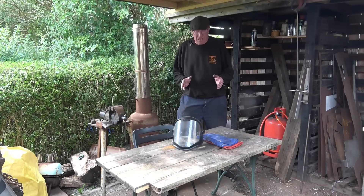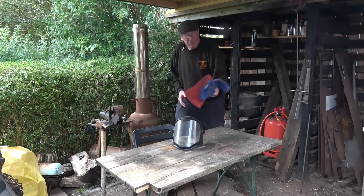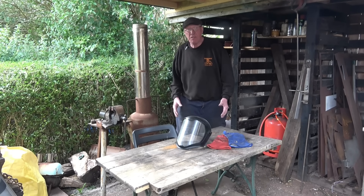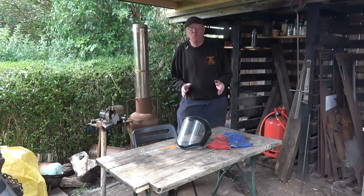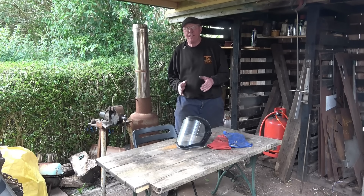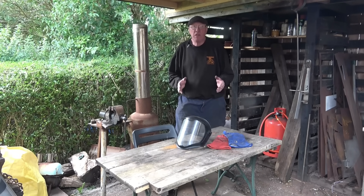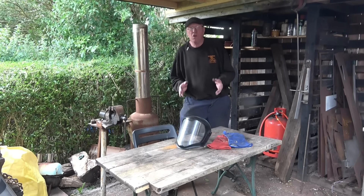Before we start doing any casting, I want to mention a little bit about safety. This is the minimum safety gear you need: a pair of decent welding gloves, a full face mask - that's a must, your eyesight is the most important thing - ideally a leather apron and proper leather boots. Also you need a bucket of water handy. When you're casting, you treat everything as either being wet or hot - molten metal doesn't like water, it flashes into steam and explodes everywhere. So all your molds, tongs, crucible tongs, anything going in - it's got to be dry and hot. Simple as that.